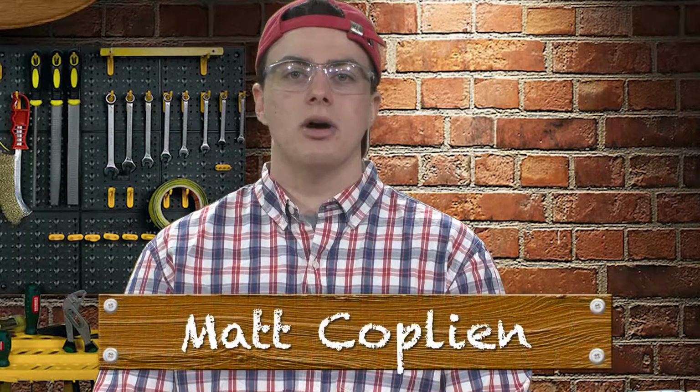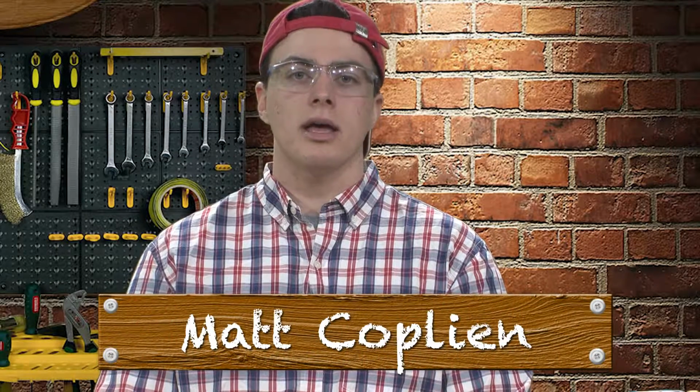Before we start, it is important to remember that with any project, safety is the most important thing. And for that, Matt has a safety tip of the week for us. Stand outside the saw's miter slots on each side of the blade, in case any unfortunate kickback occurs, so that it will be likely to pass by you. Thanks, Matt. That was a really great safety tip.